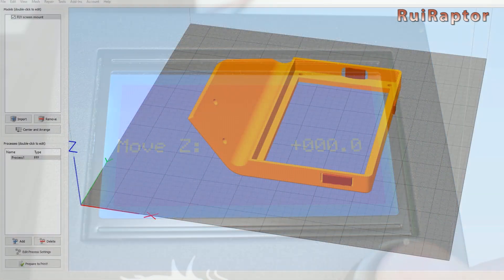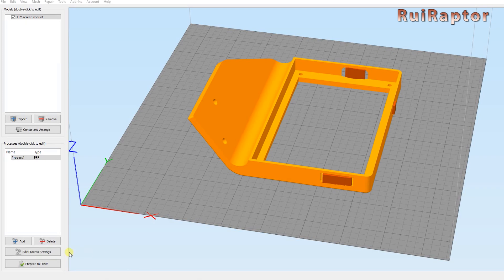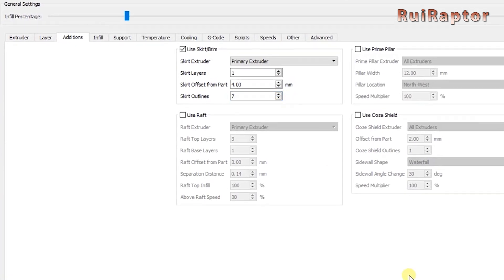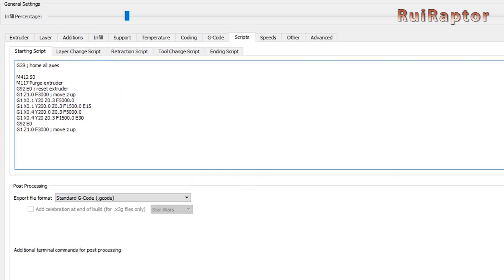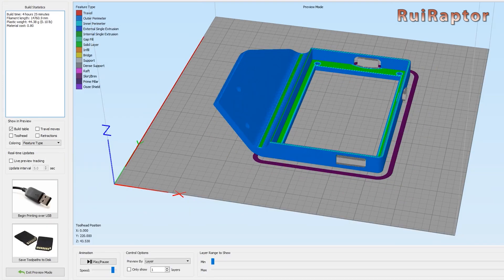But wait, there's one more test you need to run. Go to your slicer and load an STL file — any STL will work because it will be used just to test and fine-tune the Z offset. Then go to your slicer settings, enable the brim, and increase the number of brim lines. This is just to give you more time to adjust the first layer. You can revert to your old settings after the calibration is done. Next is the start G-code — after the G28 command, create a new line and include the command M420 S. This will enable the bed leveling and use the saved mesh. An alternative is to use the G29 command instead, which will run the leveling sequence and probe the bed every time before each print. Unlike the brim settings that you can revert after the calibration, the command in the start G-code must always be there as long as you have the leveling sensor installed and running.